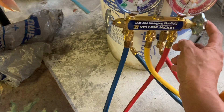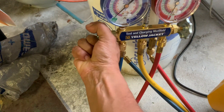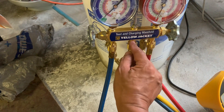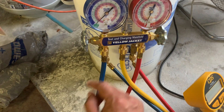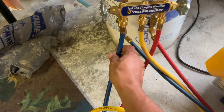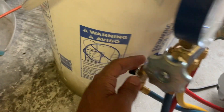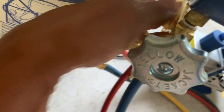The yellow hose comes all the way over here. I have my two valves closed — make sure these are in closed position, nice and tight. The vacuum comes in right here and since the valve is closed it's not connected to these red lines. Even if I want, I can open those valves and pull the vacuum on these as well, which gives me more medium as long as they're connected on the back side.